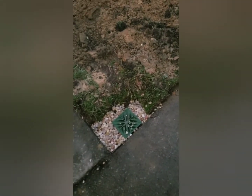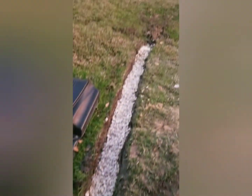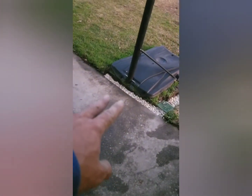I covered the hole and created a drainage system — a four inch pipe with holes in it that I got from Lowe's, goes five feet deep, and I brought the cover. I also created a trench here that goes to the lowest point you can see over there. I tested it out and it actually worked — once it flows to that low point and the five-foot-deep pipe fills up, it just flows on over, so it works!